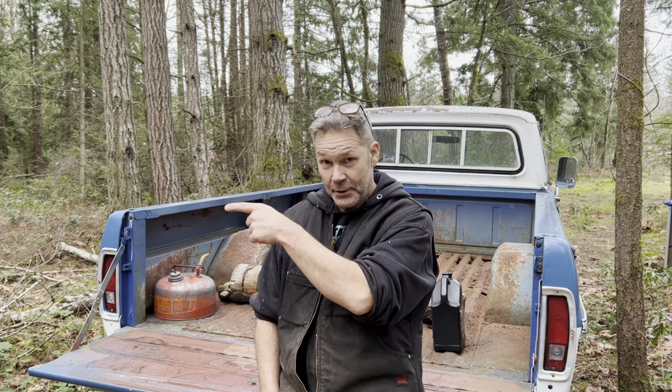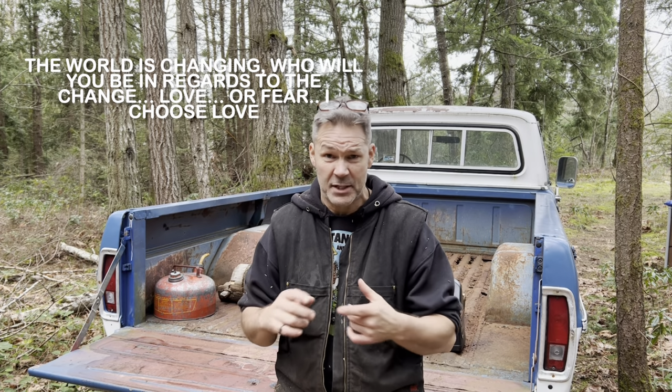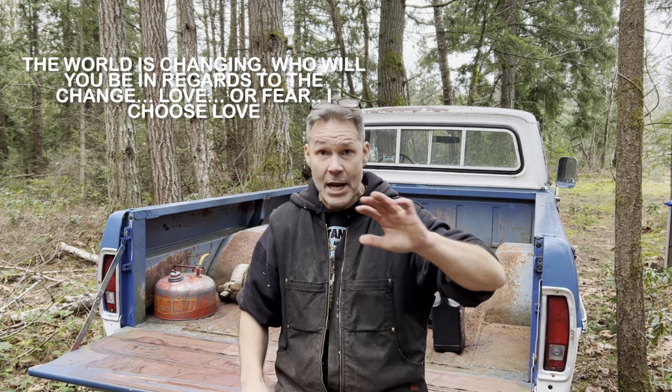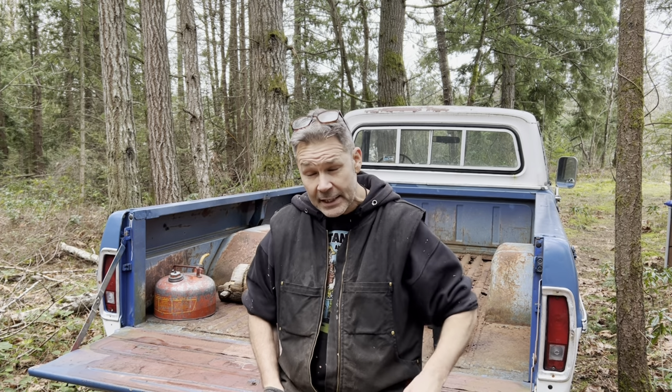Okay, I've said enough. If you're bucking small wood with these saws, here's what I suggest to you. A slightly hungrier raker, so that saw works a bit harder. If your rakers are high and you're bogging against the wood, you're gonna think this saw is terrible. We need to adapt to these new technologies that are coming out, these fuel injected, these M-tronics. I don't have an X-Torque saw in my lineup. I'm old school, friends. Look at the freaking truck. You guys know me. I let it idle there for 5 minutes. It felt like a completely different saw.